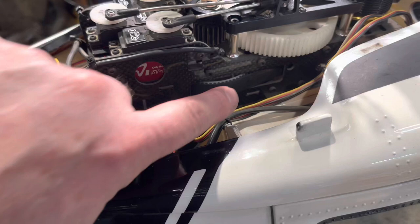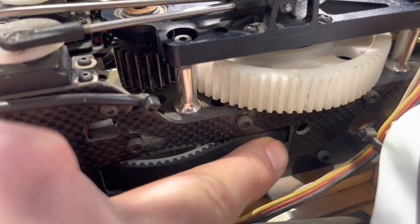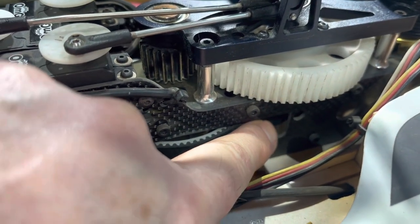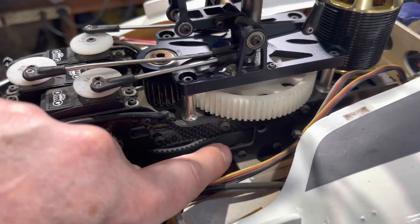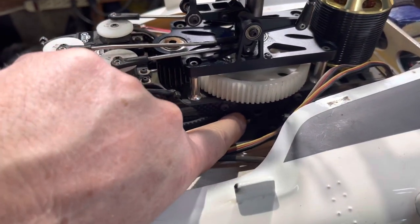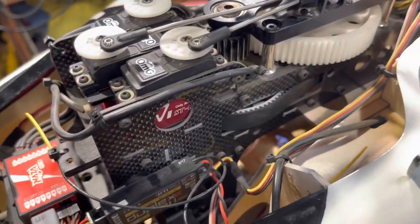Here's my belt setup and the tension on the belt. I'm barely pushing on it — I just checked my 407 and that one was a little tighter. I'm pushing it in maybe three-sixteenths of an inch. It shouldn't be too tight, because if it's super tight it creates drag, wears out faster, and can destroy a motor because the bearings get tweaked so hard. So three-sixteenths of an inch push-in is about right — that's an important gotcha to keep in mind.